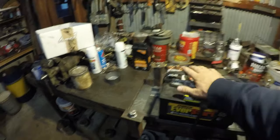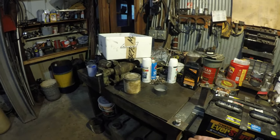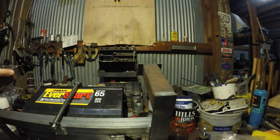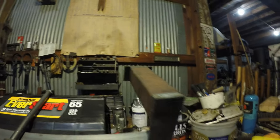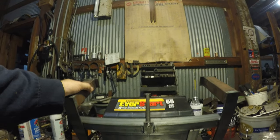This is my battery bracket that I've got done. I want to get this thing covered up underneath - about this much will be hanging down - so I just need to make a box that'll surround the sides, front, and back. The way I think I'm gonna do it is take this up and drill and tap a couple of holes in each one of these stand sections to 6mm by 1.0 millimeters, so I can have a box and just use these four bolts to hold it up and in. I'm gonna mark these spots, drill, and start tapping.